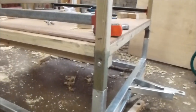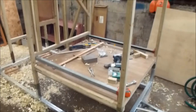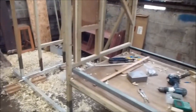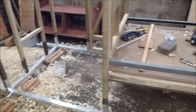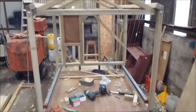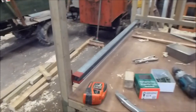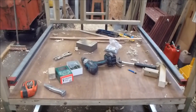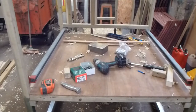The wooden structure is still being made up as I go along. The house is at this end of the whole device and it's roughly four feet square. The other end is open — that's four feet square as well, the whole thing being based on an eight-by-four sheet of mesh. The house will have double doors at this end so the back will open up completely for access for cleaning. These two runners on the side will support a piece of weld mesh, and that will give a base for the chickens to walk over. All their droppings will fall through onto the plywood which will be covered in sawdust, so it'll help keep the birds clean.